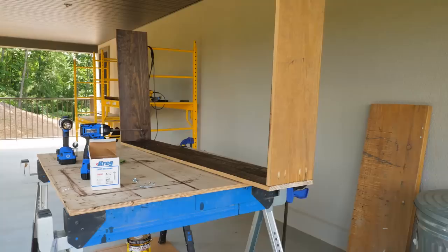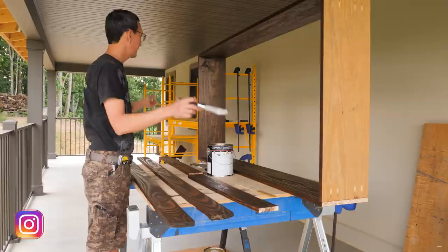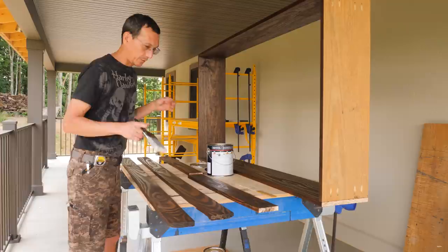So the first project here is to get the kitchen window trimmed out so that Stan the Tile Man can come back and do our backsplash in the kitchen. So that's the first one I'm going to work on. I've got the box built for the window jambs. Obviously, we had to make really wide window jambs for ICF walls. This was a 1x12. I ripped it down to, I think, about 9 3/4, and then I cut some trim out of 1x4s.